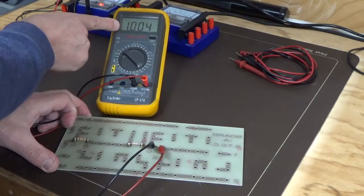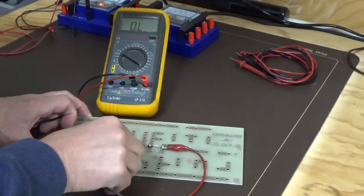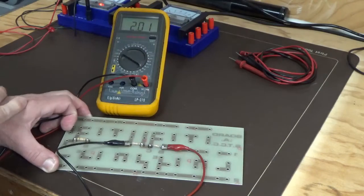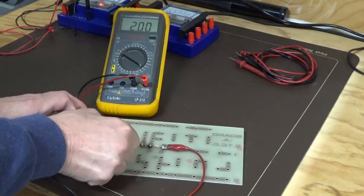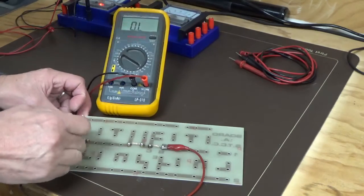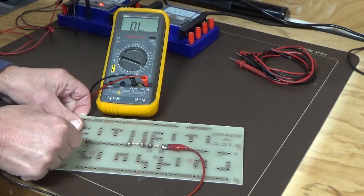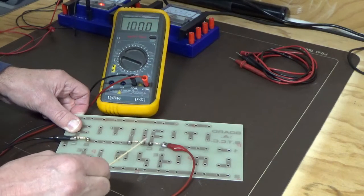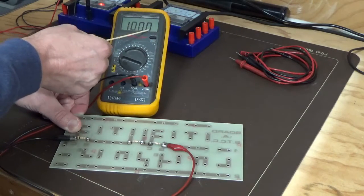You can see there on the meter, right, we've got a reading just slightly over 1k. Right, so if I move that to two resistors in series, and I'll just turn the scale up so it can measure it properly, you can see that the 1 plus the 1 makes 2, and now we're putting a large value resistor in, which will need to go up to the 200k because it's a much larger resistor. You can see here that we've gone up to now 100.1k. We've got 100k plus 1k plus 1k. Now you would expect to get 102k, but our reading is only 100k.